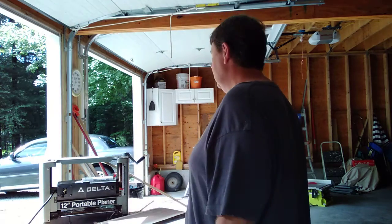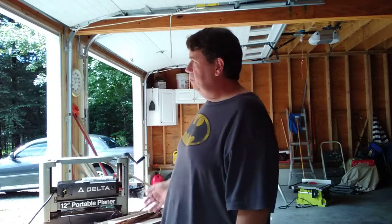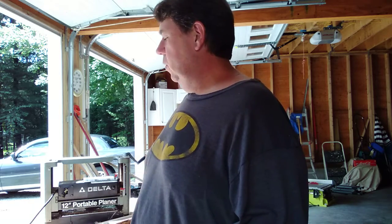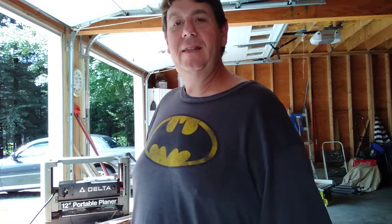You know, it's been a few days. Unfortunately, the weather wasn't with us. Now it's a nice, cool, pretty sunny day — a little bit of clouds, but for the most part, not too shabby. And you don't want to start doing all this with all the moisture that was in the air with all the rain and stuff. We're in the garage here doing it — the garage isn't finished inside — so all that moisture was kind of in the air. When you strip that down, it would get back into the wood. So even if you had sanded it, the moisture would have brought the fur on the wood back out.